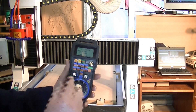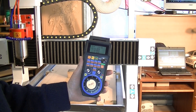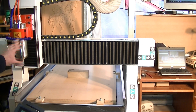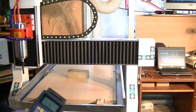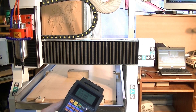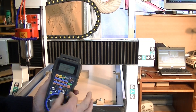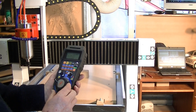What we're going to do now is use my pendant, because I'm quite a distance away from my laptop computer. We are going to set up for an imaginary piece of work — we're going to set up a work offset, because at the moment the machine is in the machine home position, which is normally the area where you change a tool. You can see this too in video number 148, where I go into quite a bit of detail about how to do this. This is a very, very precise pendant — it's the best pendant I've actually come across.